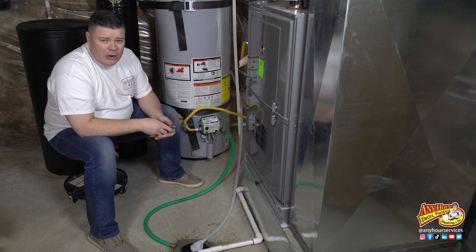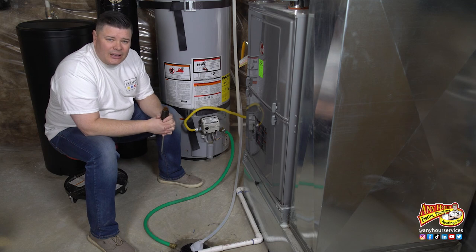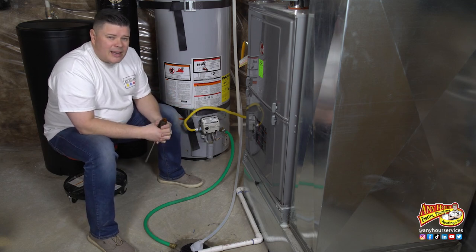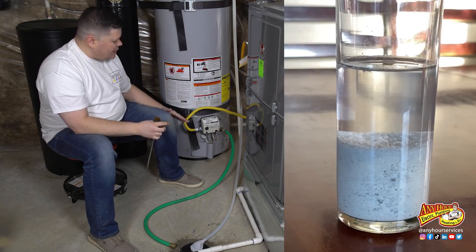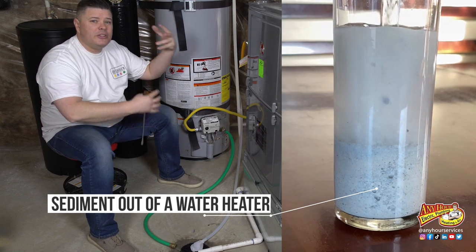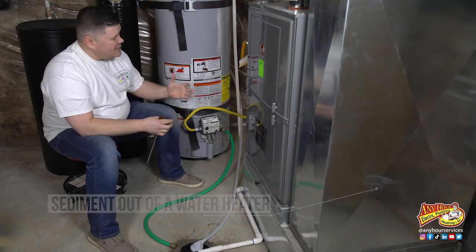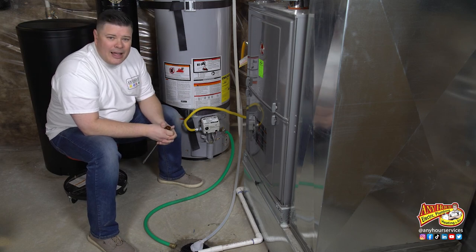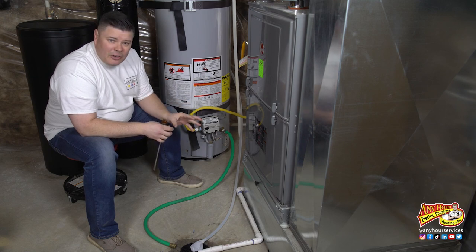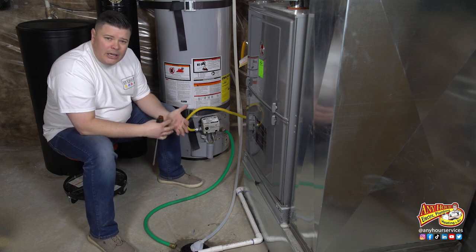The reason we're draining all of the water out of the tank is that we want all of the sediment that's floating around to either come out or settle down on the bottom. One of the downsides of the basic water heater flush is that when you don't drain all of the water, every time you turn that cold water supply back on, it churns up any loose sediment and doesn't actually flush it out — it just takes a while for the loose stuff to settle back down. A more thorough drain and flush is going to actually get as much sediment out of the water heater as you can.